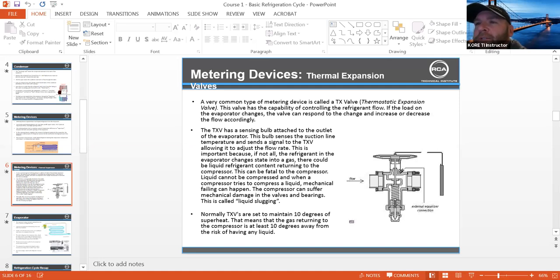Those low profiles and Mavericks — they want those at four degrees superheat. So if you learned anything today, write that down. They want those low-pros running at four degrees. That's where they're actually engineered to run.